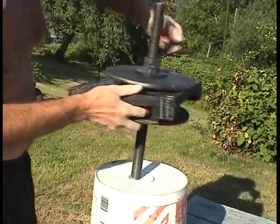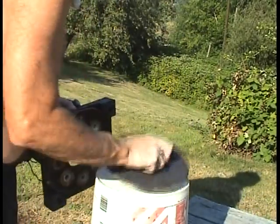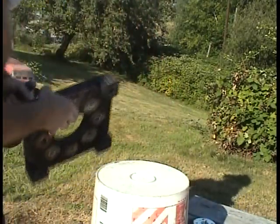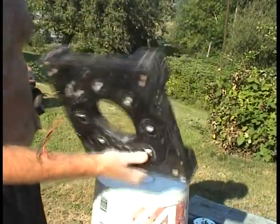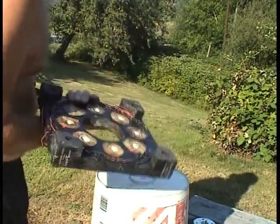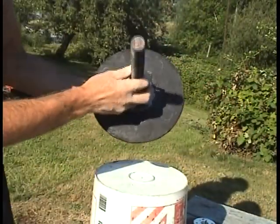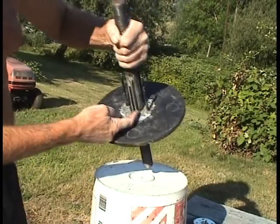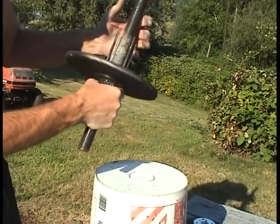And here's the last one. Here's another rotor — same thing. Another middle stator plate. It's flush on one side and sticks out a little bit on the other side so I can get the wiring out. Here is the bottom rotor, which is fairly rigid. There's a steel keyway, and these are carbon fiber rods coming up just to make it a little stronger.